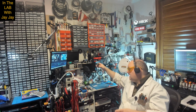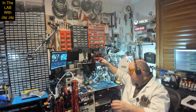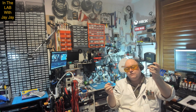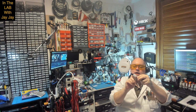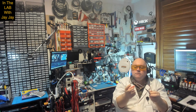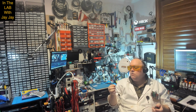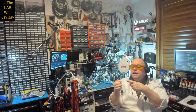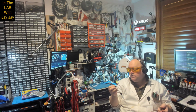And that's a wrap. So we've made our cable. You can see the whole assembly here. It's the whole disaster. We've got our battery pack through our 9-volt adapter through to our USB-A female, through to USB-A male, through to micro USB, and then we've got our HW260 board with an ATtiny microprocessor in there, or microcontroller I should say.